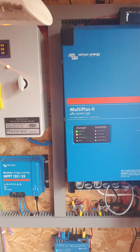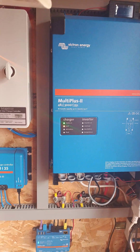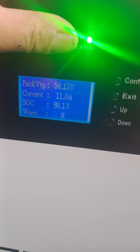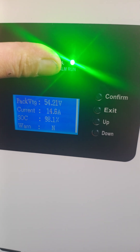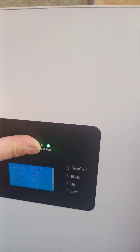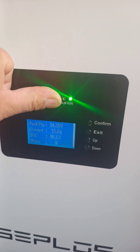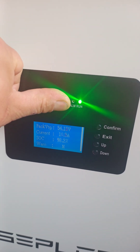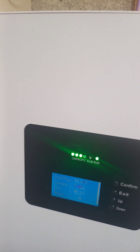As the system has been set up it's working well. The battery charging currents I've seen getting up to over 30 amps, close to 40 — and that was only to charge the battery. The Chinese wind turbine is doing well; even in strong winds it's not getting overspin, and the battery brake and controller brake are not coming on because the battery is capable of taking 100 amps charging current.